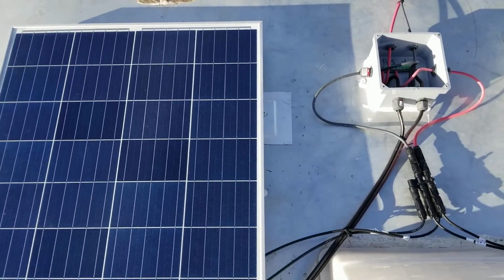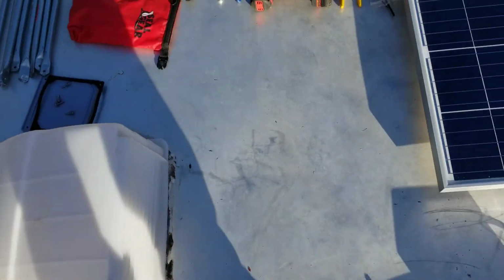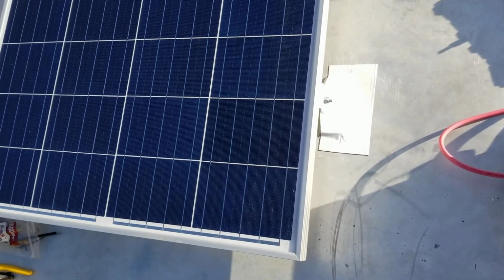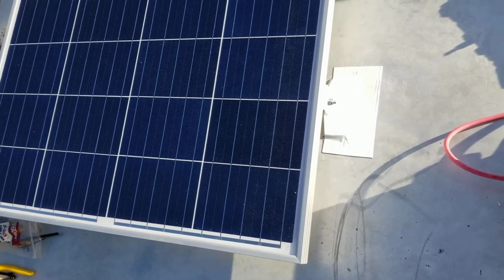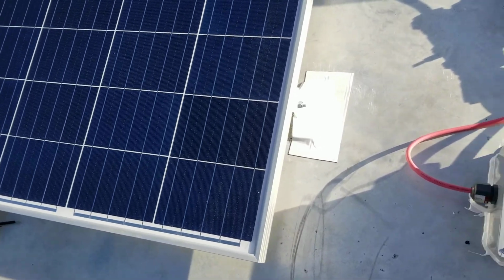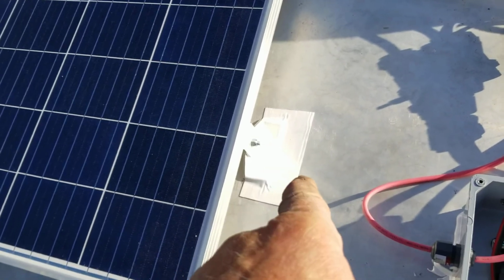Thought I'd show you a cheap combiner box. As you can see, we went ahead and went with the VHB tape. I ordered the right stuff for this application, aluminum to aluminum. Same stuff they use on a 747 holding the panels on the outside. So if it holds at 500 miles an hour, it ought to hold here. Okay, and it has Eternabond tape over it.